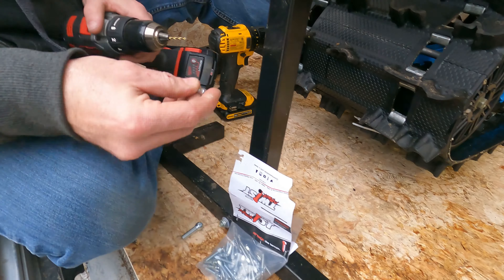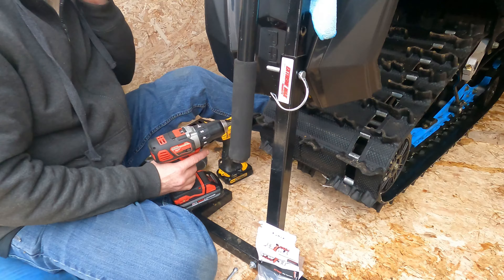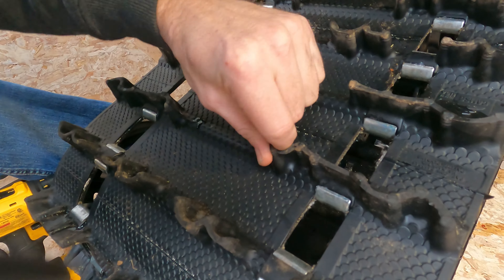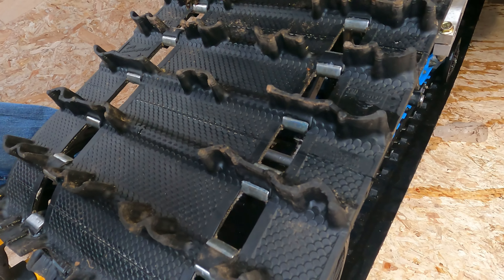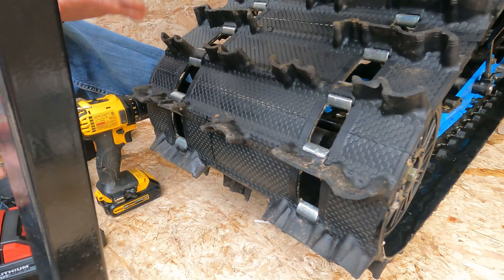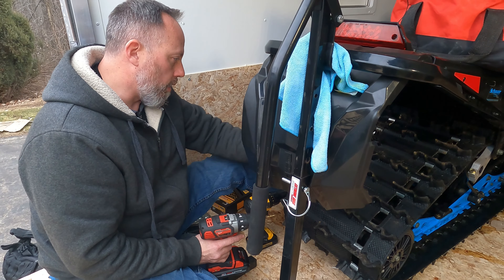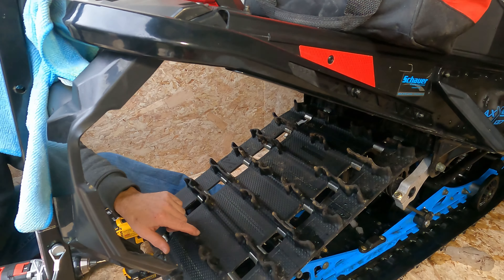So what size drill do you have there? I put a 7/64 drill bit in — it's smaller than the minor diameter of the screw. I tried to install one without pre-drilling. What it does is it takes these lugs and twists them pretty bad, and I don't want to risk a tear-out and damaging the track. I installed two earlier and when you pre-drill it seems to go much easier.